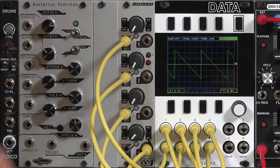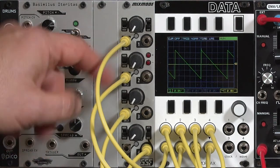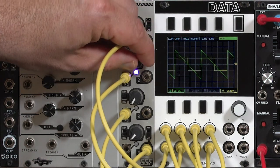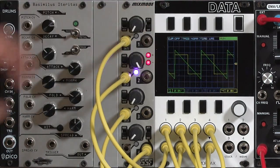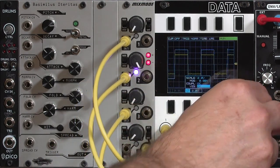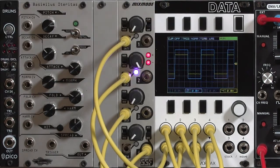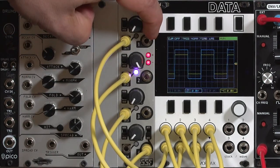It's easier to see this with a pulse wave. A pulse waveform doesn't really benefit from saturation because it already has flat tops and bottoms, but I'm going to use it briefly to show you the difference in clipping the top and bottom. Here's the output of the square. I'm going to turn off the waveform for the triangle and turn on the waveform for the input square. I can see the difference between the signals.